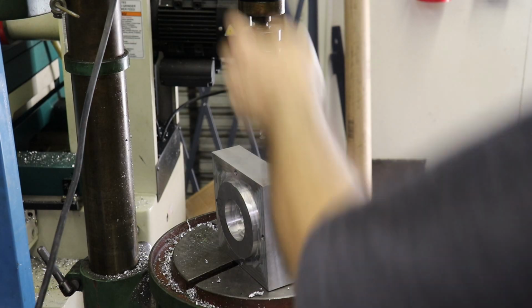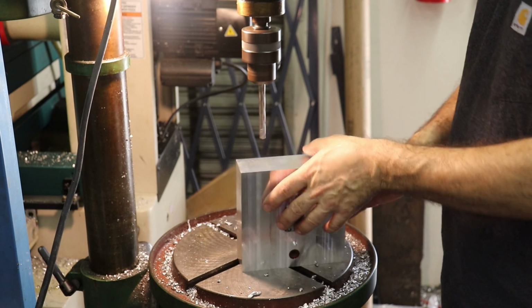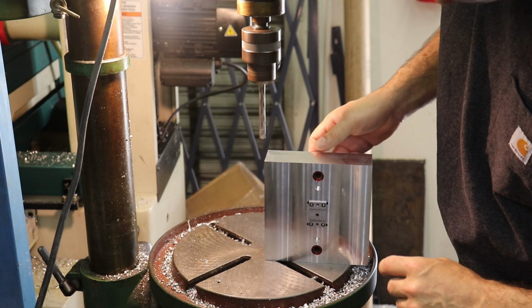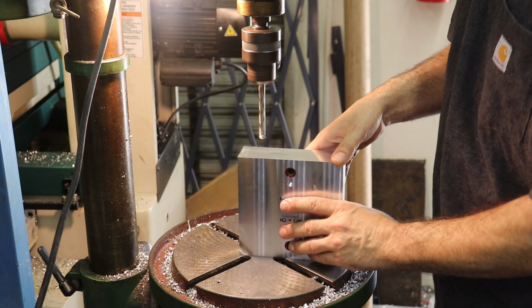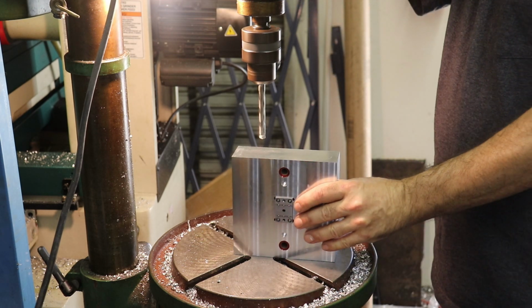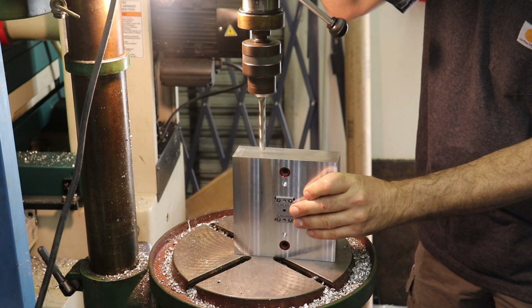Okay, today is molding day. The final thing that we're going to do is drill our heater holes in both mold blocks, because we've got to heat the mold up to about 200 Fahrenheit or 100-ish C. The cartridge heaters I use are 2 inches deep. So let's go ahead and drill these holes.